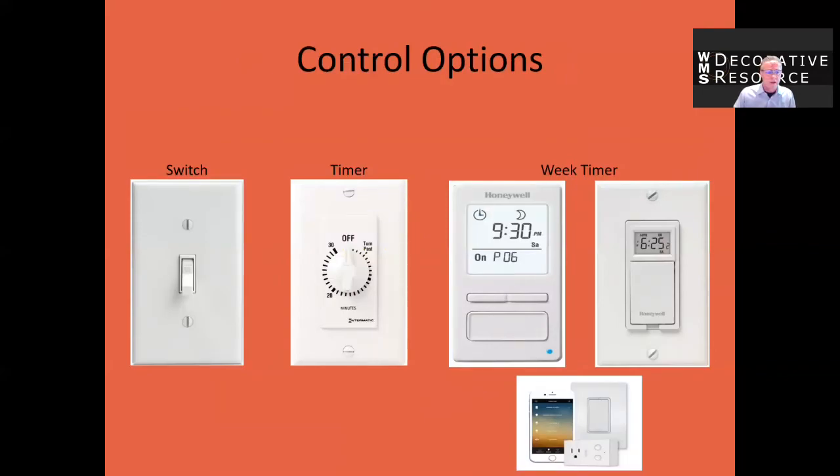Watermark Designs does not provide a switch or timer with the heated towel bars, but this is something that's readily available from a wholesale or retail outlet. The client can simply connect it to a standard switch or timer and turn the bars on whenever they're ready to use them. The ideal application is to have it wired to a programmable timer, so the client can set the bars to come on at certain times of the day and when they go into the bathroom the bars will already be heated up.